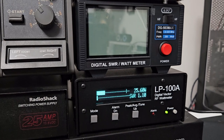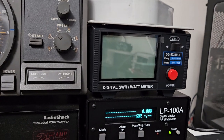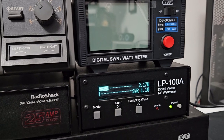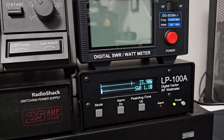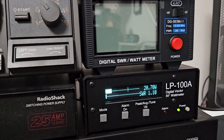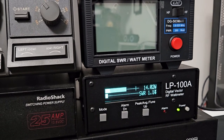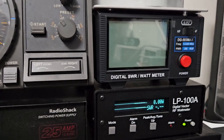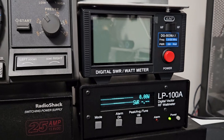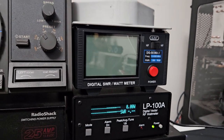It's not a real high power radio but it's doing okay — that's with it up all the way. With the RF power all the way down it's about 2 watts, and there's quite a bit of swing from it all the way down. The Rangers have a lot of AM mod. I set the level to about 93% with the tone, and with it all the way up it was about 96% with the tone. Rangers are very forgiving on the AMC so you get that higher carrier-to-peak ratio that a lot of guys want.